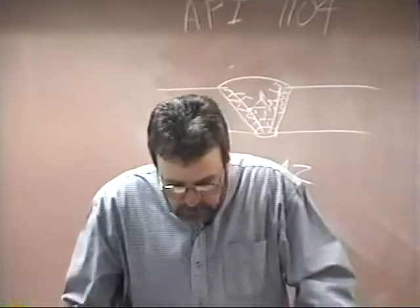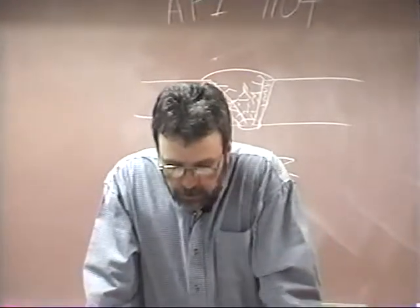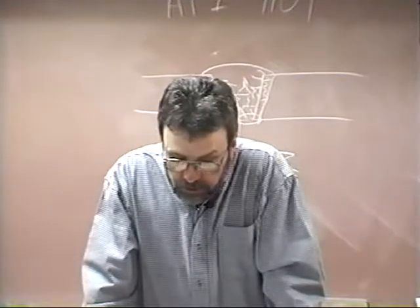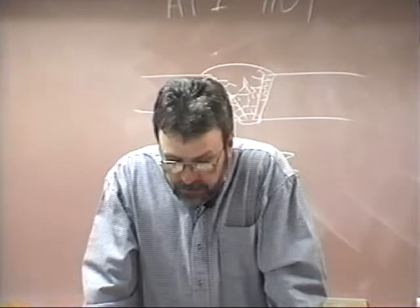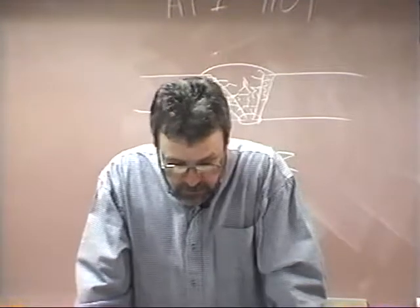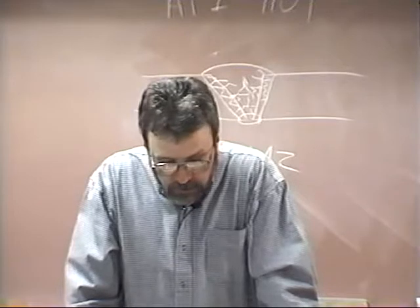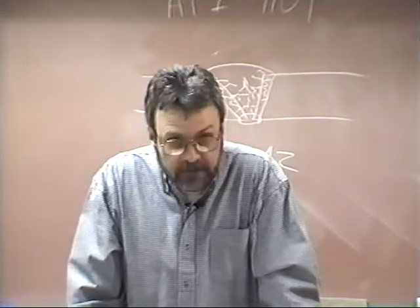Okay, underbead cracking can occur in pipes having a higher alloy content when the weld is cooled too rapidly and when moisture is present. Therefore, the weld joint should not be allowed to cool to the temperature of the surrounding air, because the heat retained in the weld will slow down the cooling rate of the next bead to be welded. In the field, this means that the second layer should be welded as soon as possible after the previous layer is finished, preferably within 5 to 7 minutes.